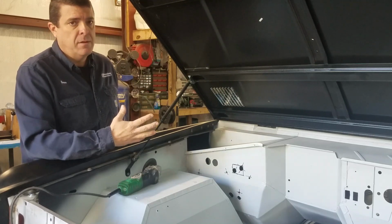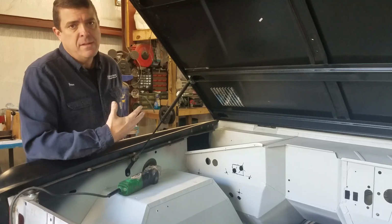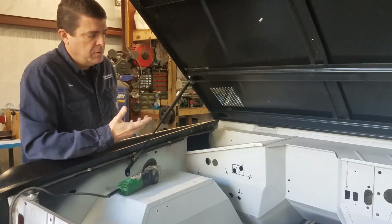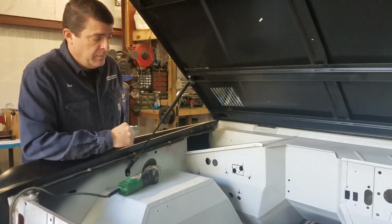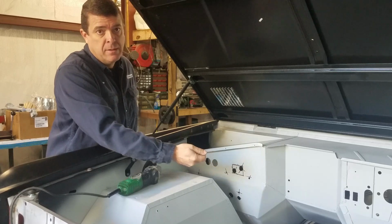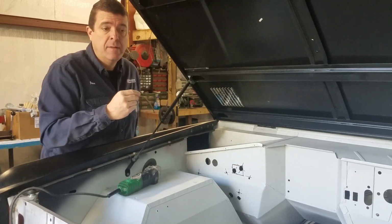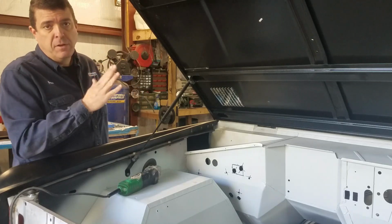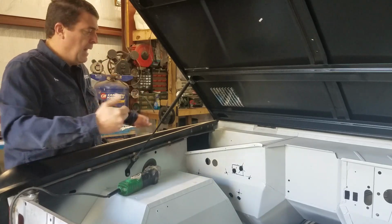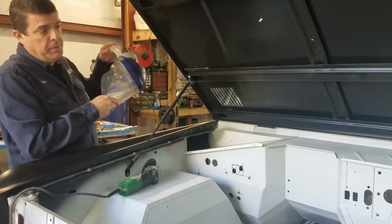It's not a bad repair. It's kind of ugly, but nobody sees that. I'm not hiding anything. It's just an easier way of welding it up. I've seen some people put a brass backer, and then you can weld against that, and basically you just pull your brass off and then you have just a weld left. But I can't get my arm behind there and do all that at one time, so this is how I'm going to do it.